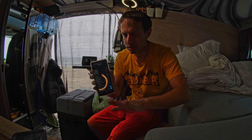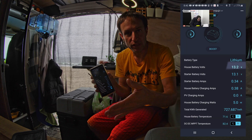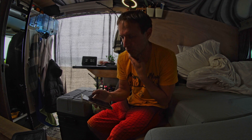I need to make a whole new video on voltages because it gets so confusing. A fully charged lithium battery not connected to anything is say 13.3 volts. The sooner you connect a load, the voltage is going to go down even though it's still charged. Vice versa, connect a charge load and voltage is going to go up. You may think your battery's charged, but it's not yet — when you have a charge load connected, your battery is not charged until it reaches over 14.4 volts.